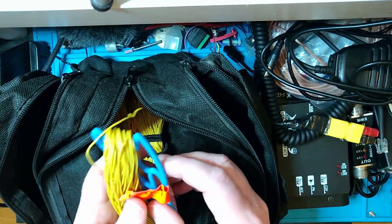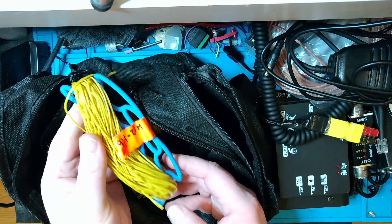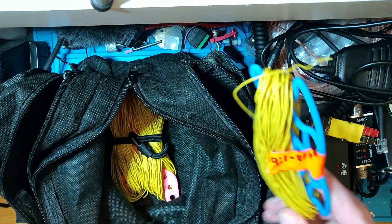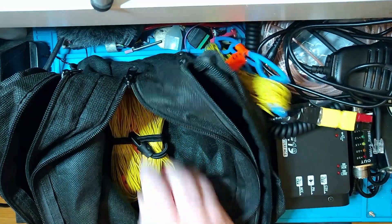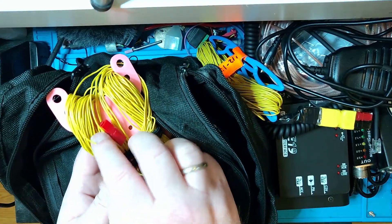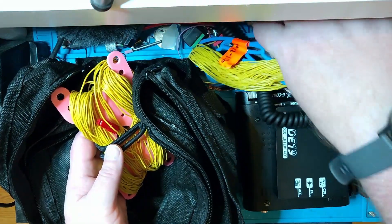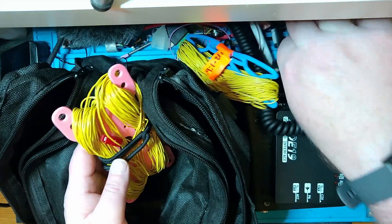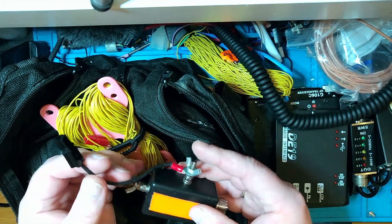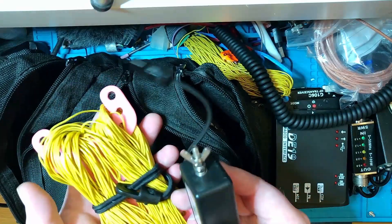Finally, I've got 21 meters of antenna wire for the 9-to-1, which should cover at least 40 through 10 meters, and perhaps 80 if you're lucky. I also have a counterpoise net, which is terminated into a power pole connector. There is a power pole connector on the balun for the counterpoise as well, which makes it easy to use the same power pole net across all kinds of antennas — in this case, a 9-to-1.